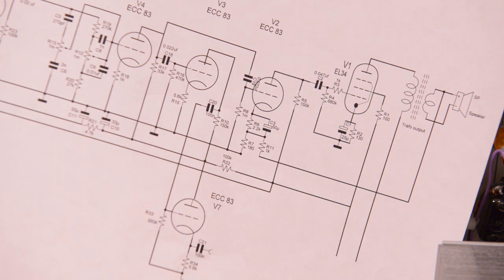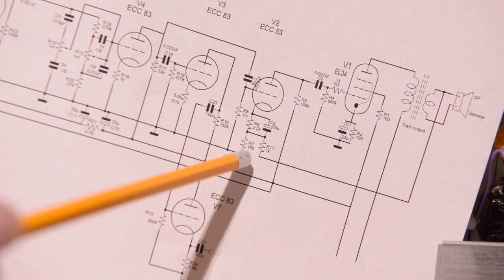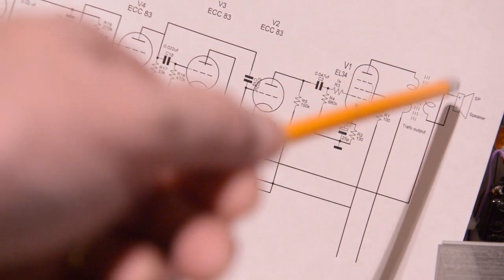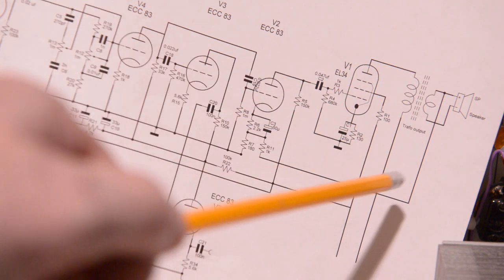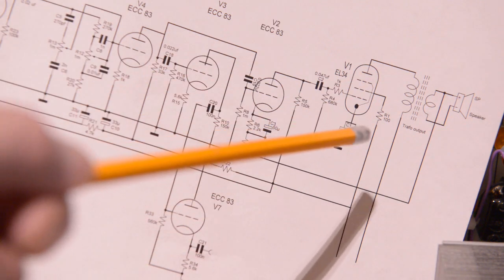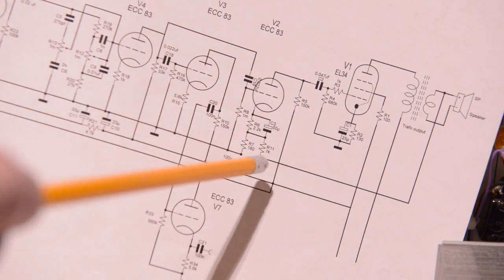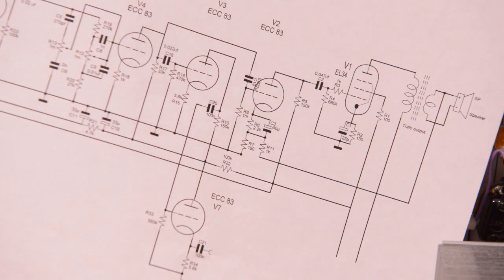Okay, there was another little trouble that caused the feedback, that one here. I tried to do that because I've done that in the past, but a long time ago. This only works when you have only one channel, then it has no trouble. But as soon as you start the other one off, then you get the same trouble again. So, okay, I removed the 1K resistor and I removed that lead. There was no trouble whatsoever. Everything was okay. There was no distortion or whatever.